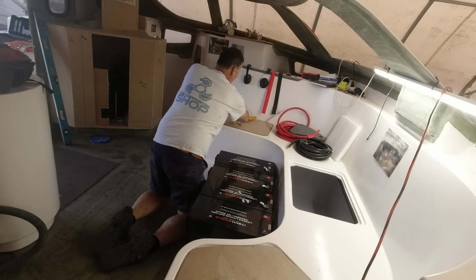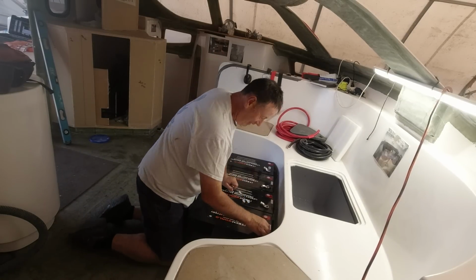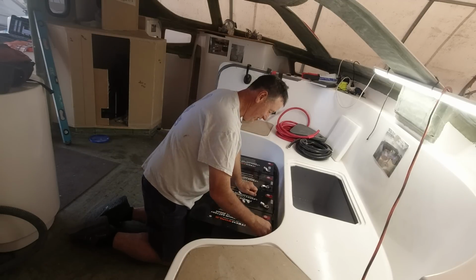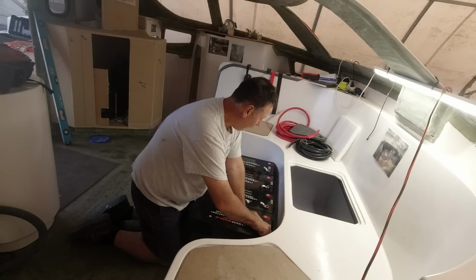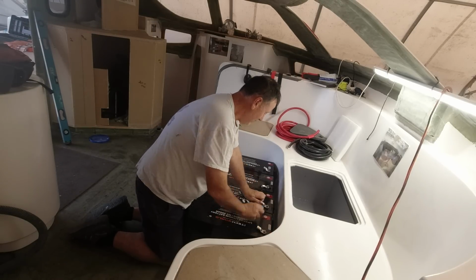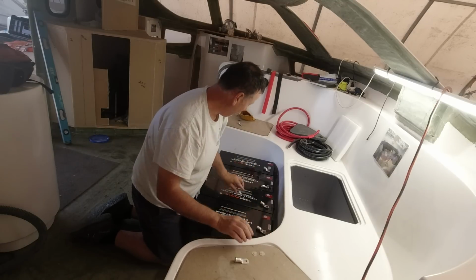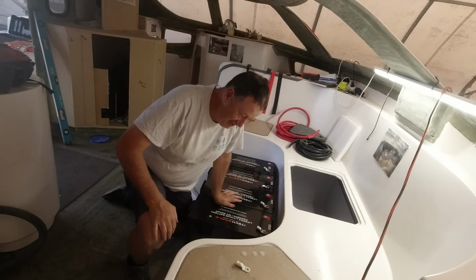And we're going to measure, cut. Yeah. I'm not going there. Sorry, mate. I'm Explorer's life. We're going to jump on your bandwagon. Measure, cut, crimp, shrink, and install. I feel like I need a t-shirt, honestly. 4-aught wire. With a 5/16 lug. With a 5/16 lug, yeah. Actually, it is a 5/16 lug. Indeed.